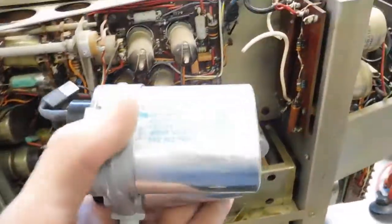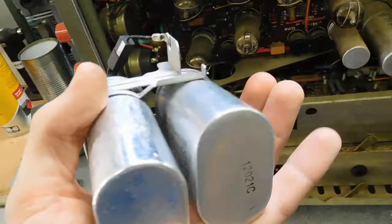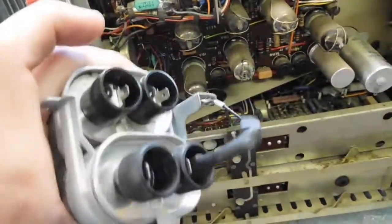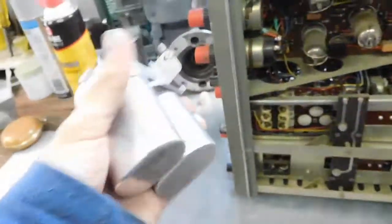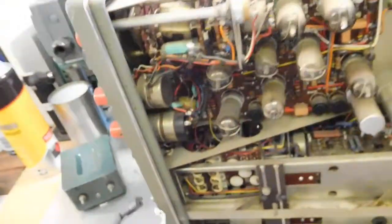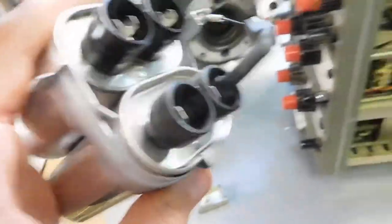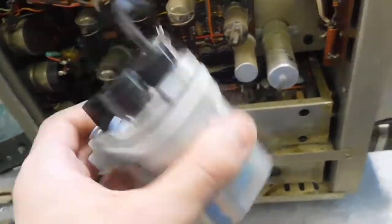Option A is to directly replace those caps. I've got these two microwave caps here — both are 0.9 microfarads at 2000 volt AC. If I put them in series I get 0.45 microfarads at 4000 volts AC, which can be used on DC. That's potentially over-driving the cathode ray tube by 0.3 microfarads, but theoretically it should work. I don't really want to put them in just yet in case I end up nuking some sensitive electronics or blowing the CRT up.